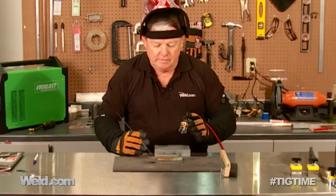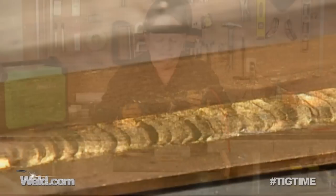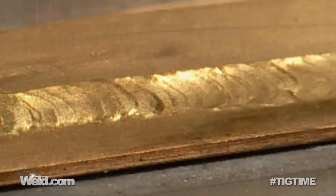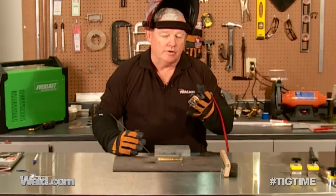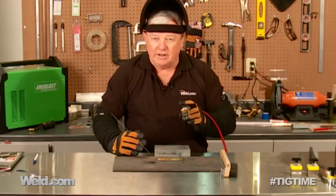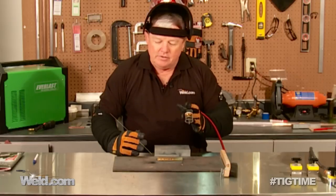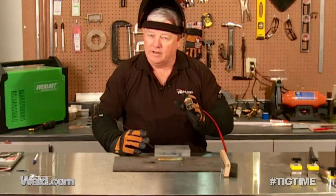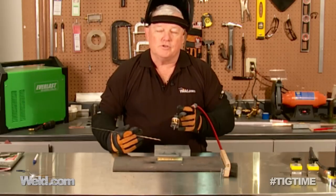Now that I've brazed up this material — brass on brass — just know that it's a lap weld, and it's about 16 gauge material, so I can get by using argon gas. Now, you can take brass fittings and heavy wall material, but you're probably going to run out of amperage out of your machine, so you might want to go to helium gas when you do that. We'll do that on a later episode. I can't reiterate enough — make sure you have adequate ventilation, just because of the outgassing, the smoke that you can see coming off this material.